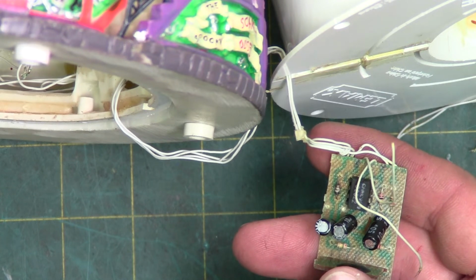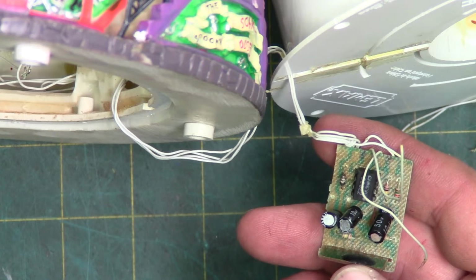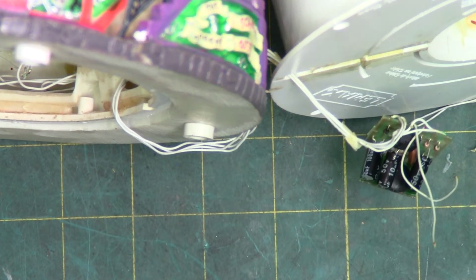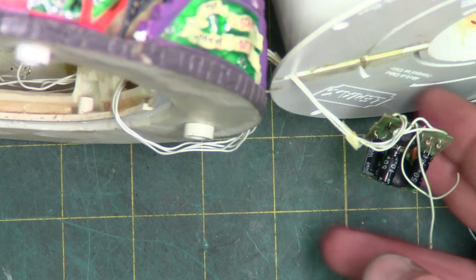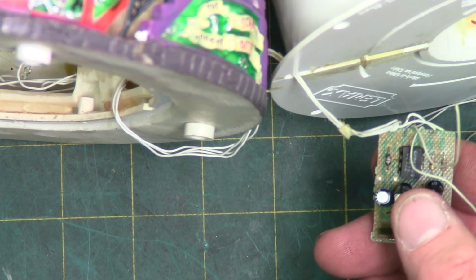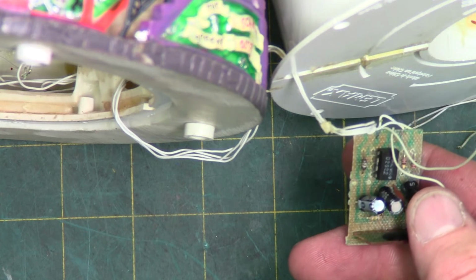is also 1K or 1,000 ohms, and the one on the right is 375K, which I thought was wrong because that's what my meter was showing. And then I looked up the color bands just to make sure I'm not blind, and yeah, it's a 375K ohm little itty bitty resistor. This chip is an amplifier chip. It is a D2822 amplifier chip right there.